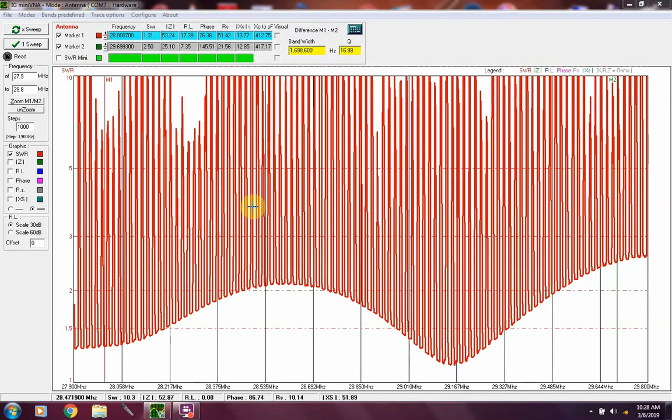What's going on there is, I believe I'm picking up 10 through harmonics. I did some math the other day, and for the harmonics on the antenna and antennas in general, my 160 wire is actually giving me 60 meters, 12 meters, 10 meters, and 6 meters due to harmonics. My 75-80 meter wire gives me 11 meters, which if you've got a CB in your shack works out well for you, I don't. Nothing opposed to them, I just don't happen to have one up and running. Anyway, it gives me 11 meters and also 6 meters.